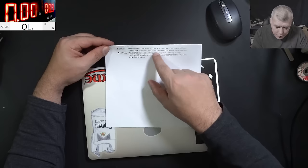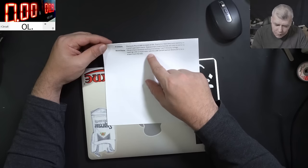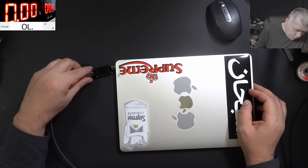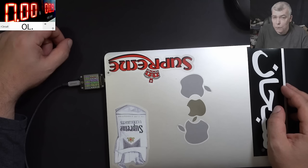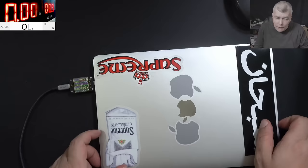Replace motherboards are hard to come by. Visual check, nothing interesting. I can't find any voltage. With a multimeter and the USB current sensor, it shows 5V and 0.1A drawn from the wall. Let's plug the charger and check. The meter is coming on - 5V around 40mA. So clearly this laptop is dead. Pressing the power button, nothing happened. Let's open this laptop and try to figure out what is wrong.